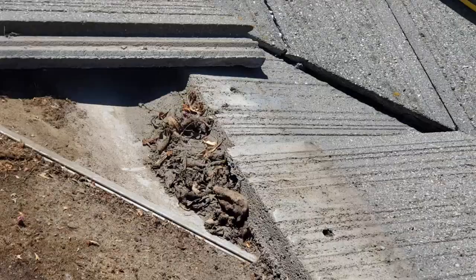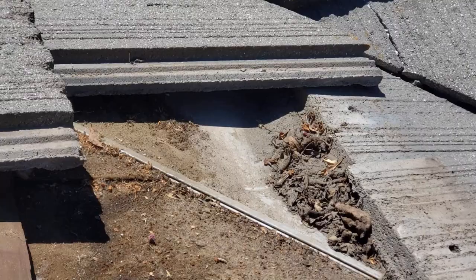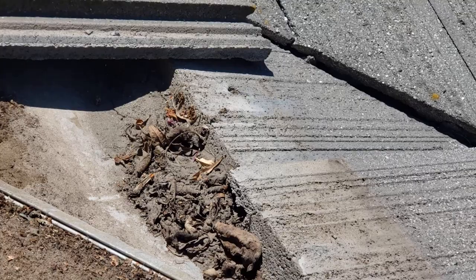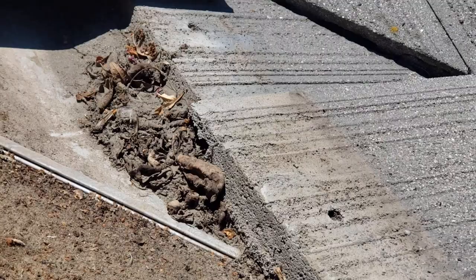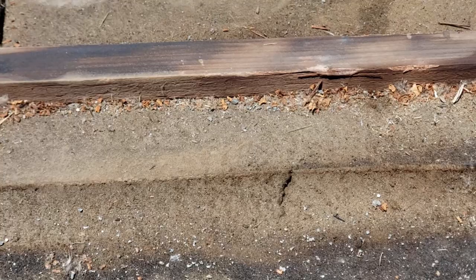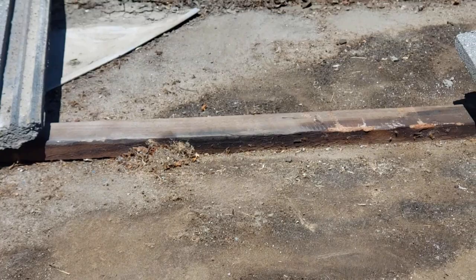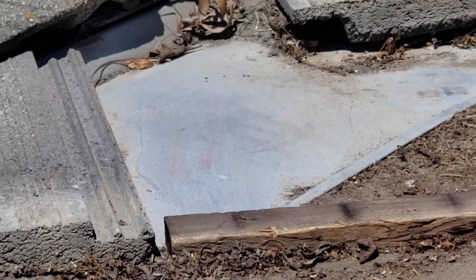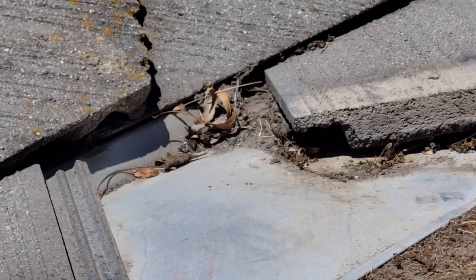Already we've got some good examples here. You can see the valley metal where we've removed the tiles — the tiles stacked around. The valley metal is completely dammed up with debris right here. This is what I'm talking about. Water comes down, it's all dammed up, can't follow the valley, so it follows the debris off to the paper. You can see that some of the paper is stained from being wet, and the battens on top — these redwood one-by-two battens — are stained, and the staining continues on down. There's another spot right there where the valley is dammed up once again. The water is getting off the metal and onto the paper, and that's where the problems begin. Once it gets off the metal and onto the paper, we start getting holes burnt in the paper.